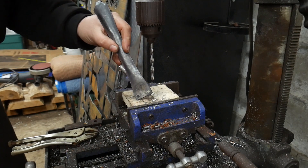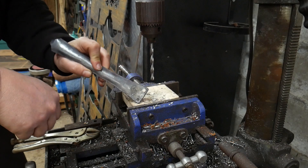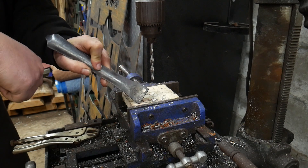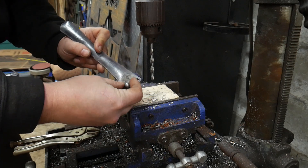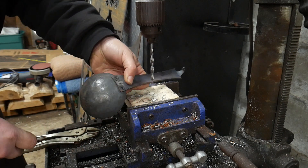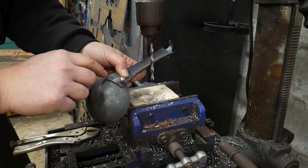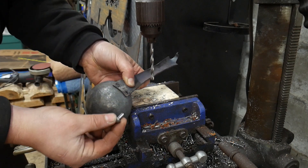Here we are — we have our hook tail handle and we've drilled the holes. I center-punch marked them about a quarter inch in from each edge, triangulating on the corner, so it leaves about an eighth inch all the way around for a quarter-inch rivet once the head goes through — that's the key measurement. My method is to clamp, drill one hole, rivet it up, then come back, drill the second hole, and rivet that up.